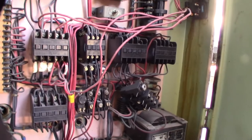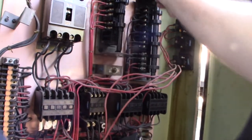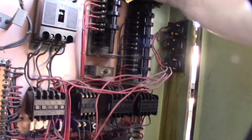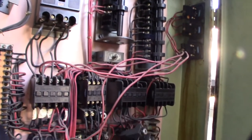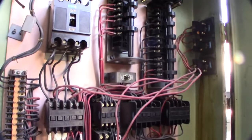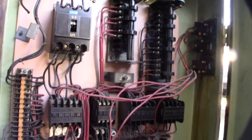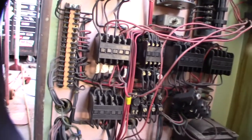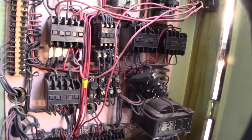Look at these old electronics — the cams, the on/off cams. This is the reverse on the front here. I want to redo all the wiring. The guy originally said it was 2.8, and he said single phase, but this looks like three phase to me. I'm getting a VFD anyway, and three-phase motors are better for variable speed.